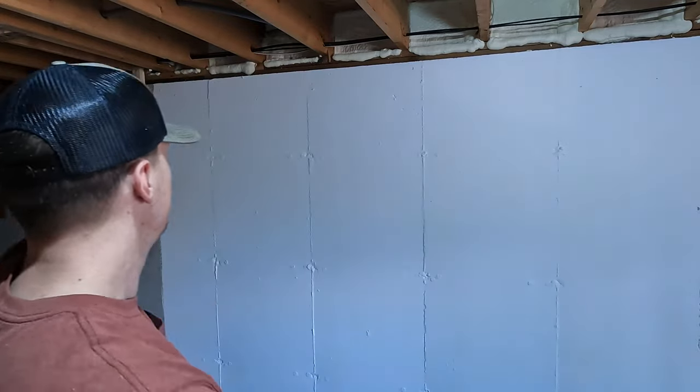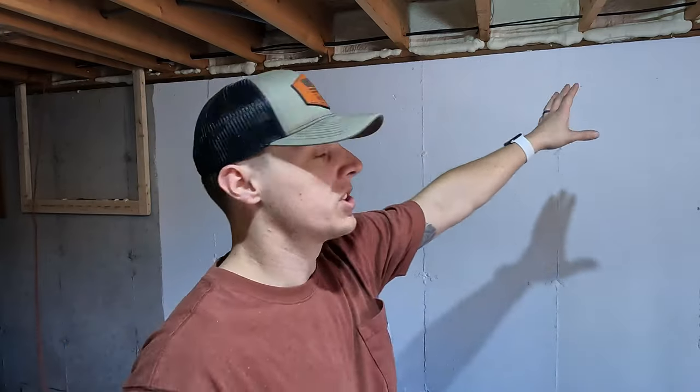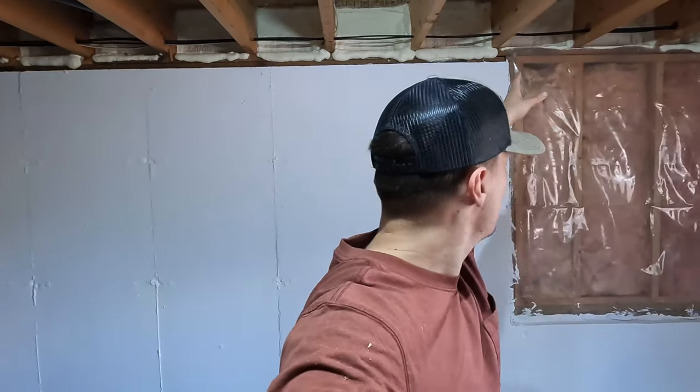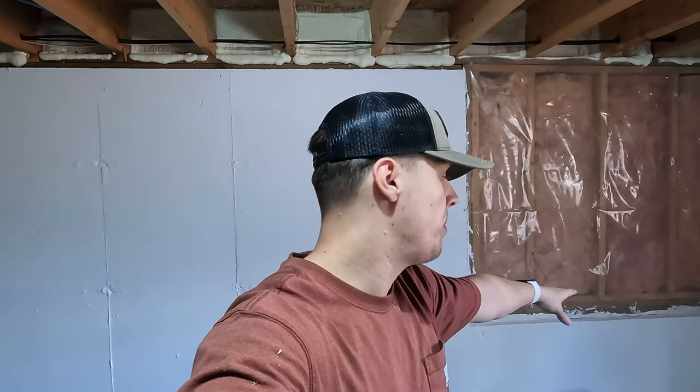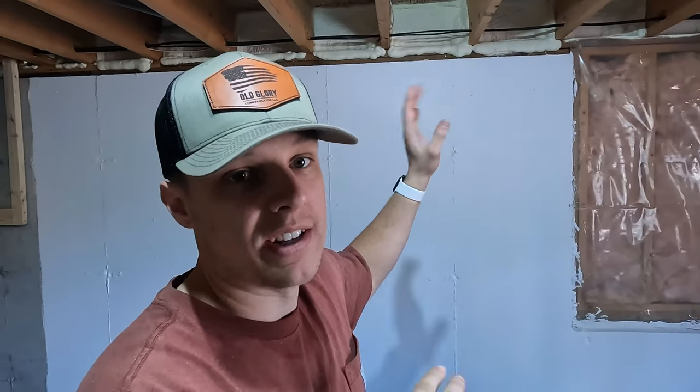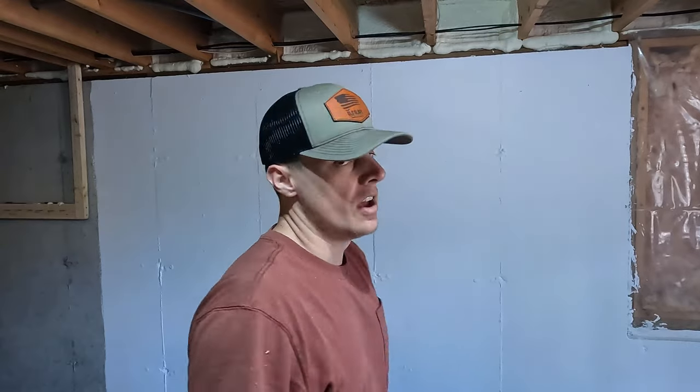All right, guys, so I'm going to take some measurements right now for our walls. This is going to be to the top, and then we're just going to use the existing framing here for the drywall. So we're going to cut it off here and then bring it down, and then we're going to have a partial wall on this small area over here. Same piece, we have a 16-foot bottom pressure treated plate, and then the top, we just got a 10-foot because it's a 9-foot section here. That way, you know, you're optimizing your wood.